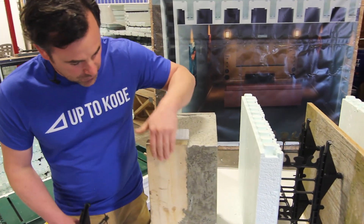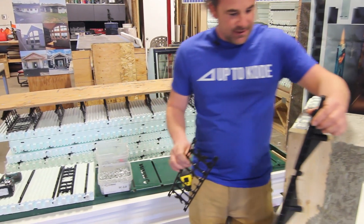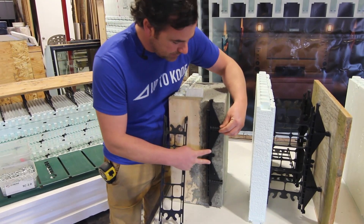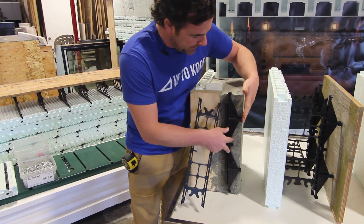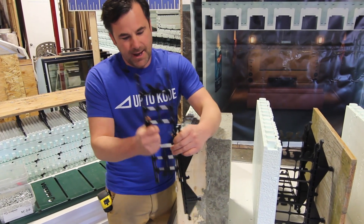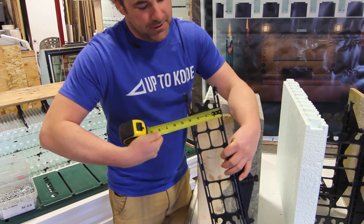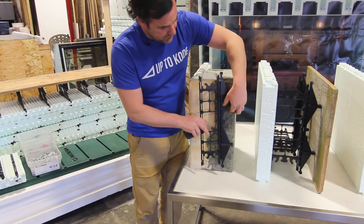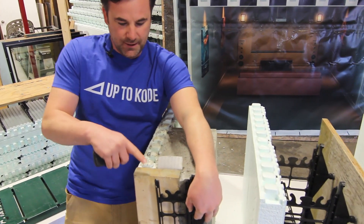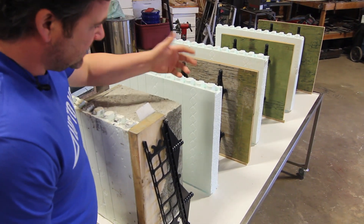Here's a little poured section — we showed one window buck as an option. How the system works: this is called a multi-link tie. This adds two and five-eighths to your wall, and you need this little multi-link tie to attach the form ply. This is a six and five-eighths concrete core, and that's because we're going to add in this four-inch web. The four-inch web gives us a six and five-eighths concrete wall because it snaps into the formwork. This gives you the background on how and why we can add insulation to the series.